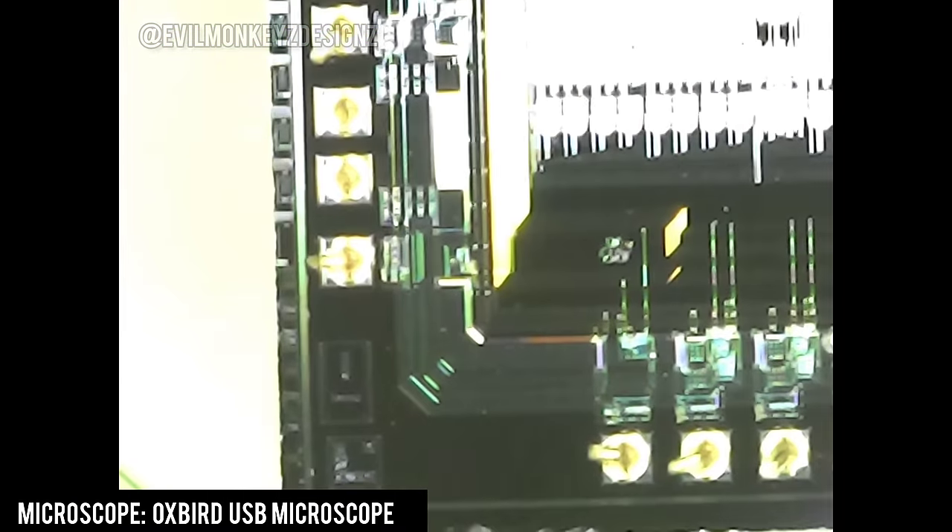There's a lot that can be said from this comparison, but I think the biggest takeaway is that none of the digital microscopes lived up to their maximum magnification specification. If you're thinking of getting into the chip inspection hobby and looking for a microscope, I would highly recommend avoiding the cheaper USB digital microscopes and instead purchasing a metallurgical microscope — there are many options besides the Amscope one featured in this video. If you enjoyed this content consider subscribing, and you can also check out my Instagram and TikTok, support the channel by watching other videos, or head over to my store for PCB coins, stickers, or silicon wafers. Thanks for watching!